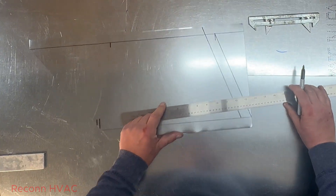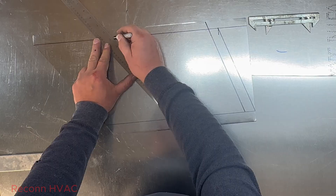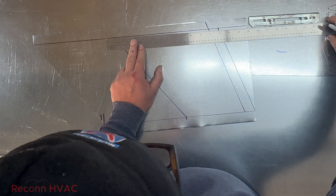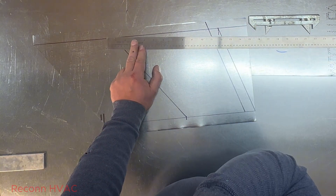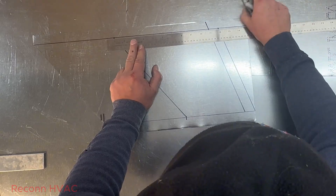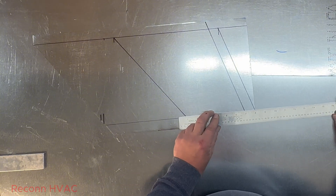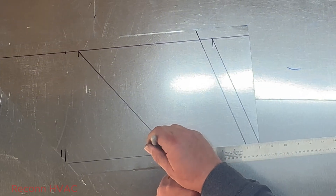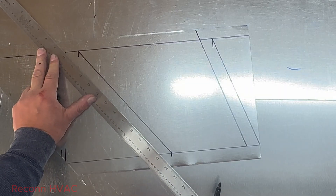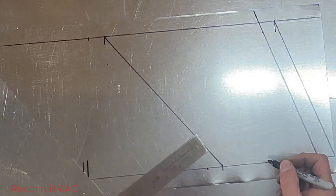You'll see why in a minute — why you don't want to add them in sometimes if they're real steep. We're going to 10 here and we're going to 6 here. If I would have added both of those in — say this was 15 and I added that in — this would have been eight with the two allowances with Pittsburgh. If you added that in, this is how much you would have lost: you would have ended up with three quarters of an inch short. So let's put our Pittsburgh on.